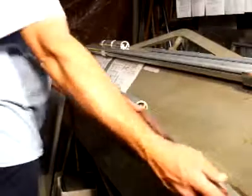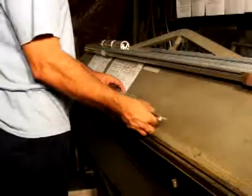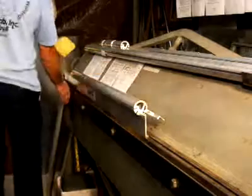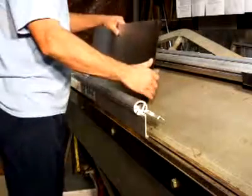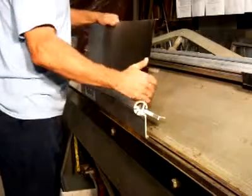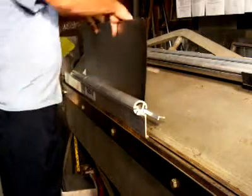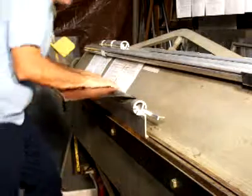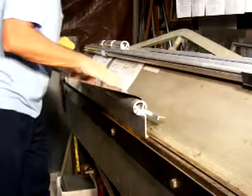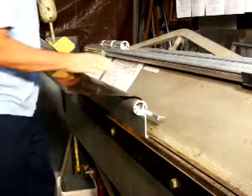In this step, we're going to use the L shim inside the T slot. This is used for doing a single flange bend or a U-shaped bend. When you're doing the single flange bend, the single flange goes into the multi-roll slot with the angle, and it doesn't clamp and hold material like a handbrake, but it twists just enough to put a little pressure to keep it from slipping out on the ends when you're doing a long panel. Not necessary to use this method on short panels, as you could pull from the slot on the opposite side that's facing you by simply turning the die around.